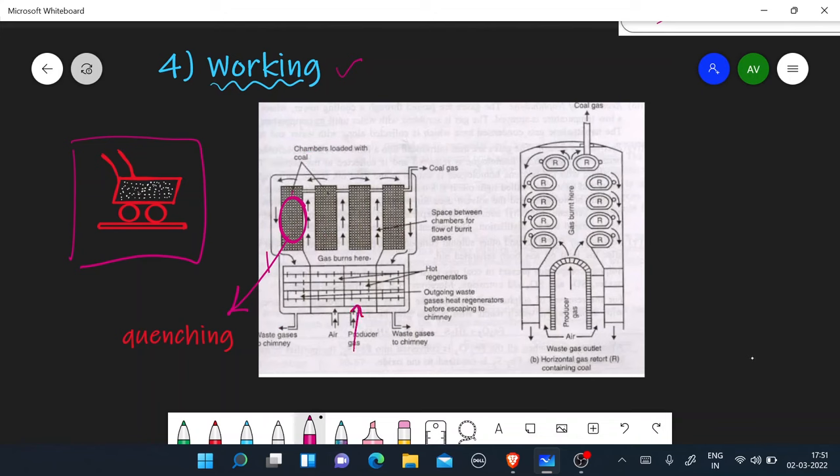We give producer gas input at a temperature up to 1200 degrees Celsius. This heats the regenerators and checker brickwork, heating up all the bricks. When heat-up happens, the coal burns. During combustion, waste gases are produced. These waste gases pass through the checker brickwork in the regenerator, warming it up so that the producer gas input does not need to be pre-warmed — the heat is returned to the chamber.